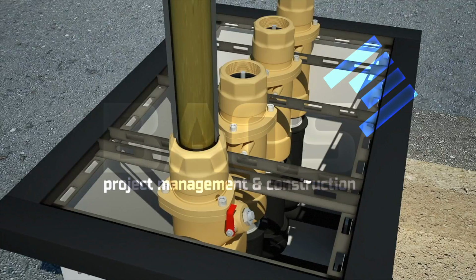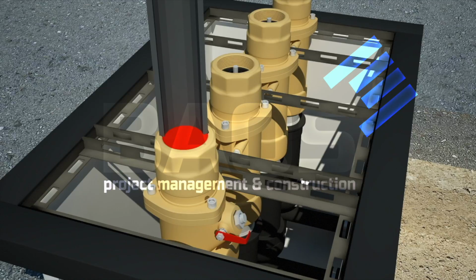The shutoff valve shuts off the fuel both on the product side and the dispenser end, thanks to its double poppet design. Due to its fusible link, tripping the valve closed at nearly 74 degrees Celsius, it shuts off the fuel supply and provides protection against fire.